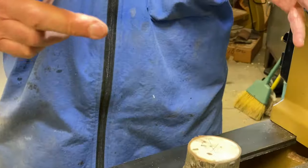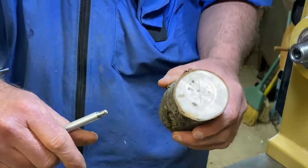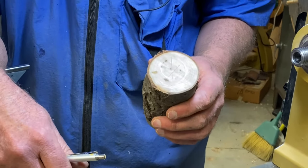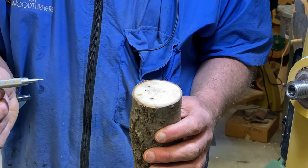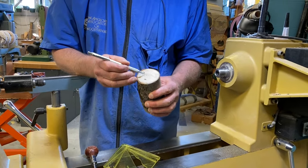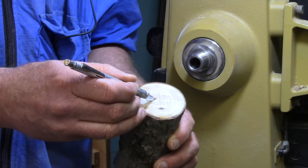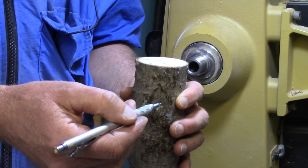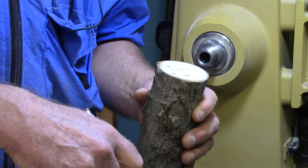With a larger green piece of material, something that was recommended by one of my many mentors, Dr. Charlie Sheaf, is that with hollow form, which I've pretty much exercised most of the time, if I'm doing hollow form turning with a larger project, I do use the pith as the center of the project. And I know you can use either side of the center, but you can use the center if you have enough material for the design that you're after.